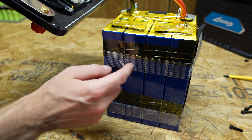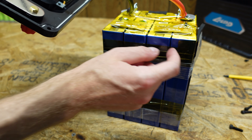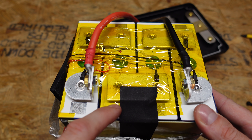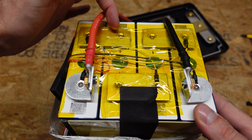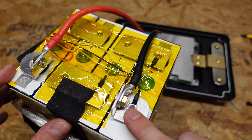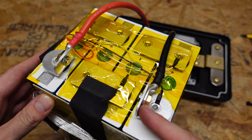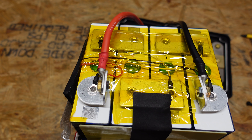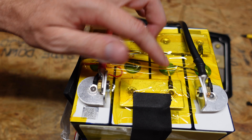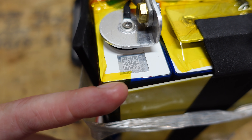The batteries are all nicely lined up and spaced with some thinner padding between them — about a couple of millimeters apart. The terminals are held on with small screws and appear to have been laser welded after the fact. The laser welding looks pretty good. The cable connections use a welded nut bracket with one bolt and no washer or lock washer. The individual balance leads use decent-sized wire with heat shrink and ring terminals. The cells do have their original QR codes intact, though unfortunately they don't identify the cell type or capacity.